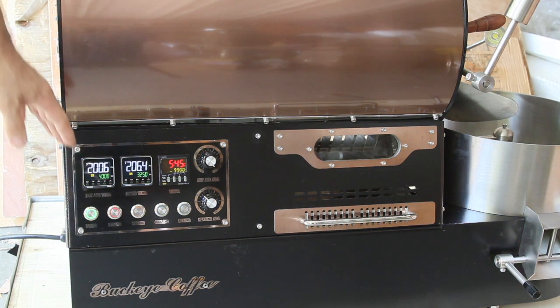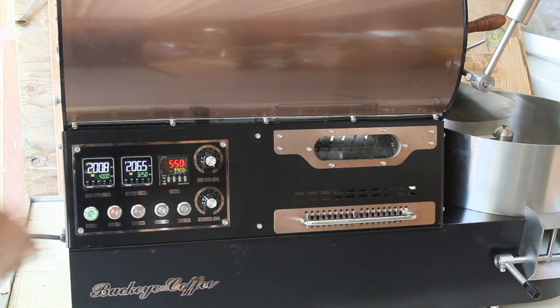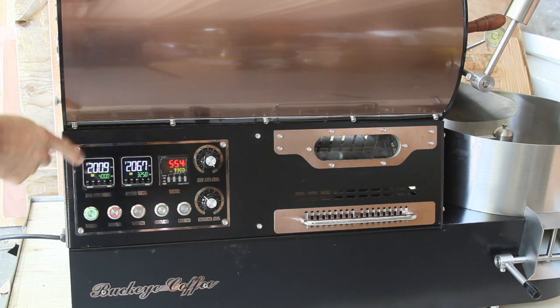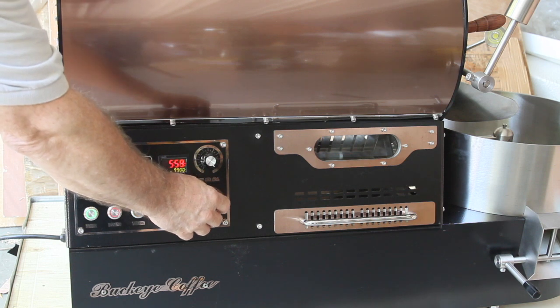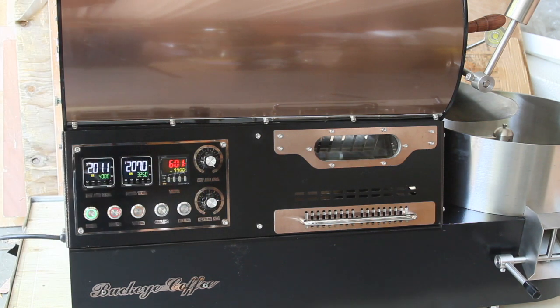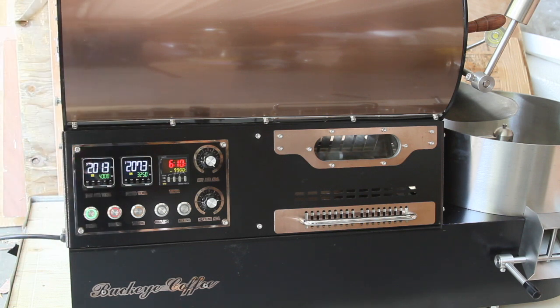And as you can see, because I had turned the temperature heating adjustment down so far to 30, we're pretty much keeping it steady at 206 degrees, which is great if you wanted that. But if you wanted it to rise more, you would up the heating adjustment. You would see after 30 or 60 seconds, when those elements get fully hot, they will turn bright red if you turn them up to 10 after a moment or so.